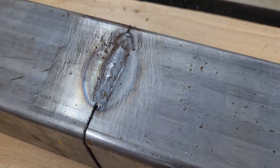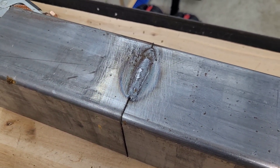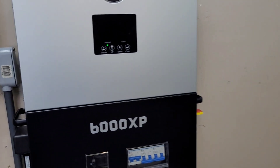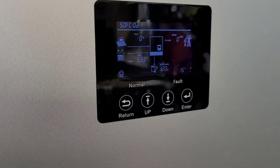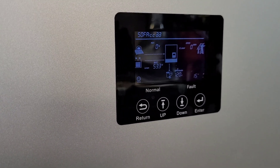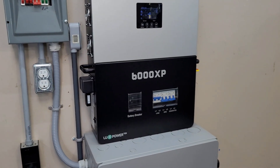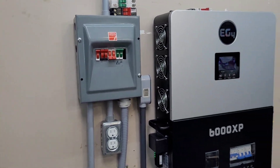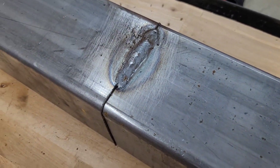There's my ugly little weld — I wire-brushed it to get some of the carbon off. I ran a longer bead to let the XP ramp up and see how much power we were using. It put a pretty heavy load on it — I saw right around 5,000 watts and 85% of the output capacity, and that's with a 12,000 BTU air conditioner running in the garage as well. I'll pop the app up on screen so you can see the big spike in power. Overall it handled it very well — running a welder and an air conditioner at the same time. Pretty convenient to have my welder plug on the load center panel. Let me know if that's a good weld — I'm pretty sure it's hideous, but I could be wrong.